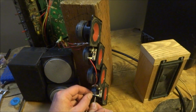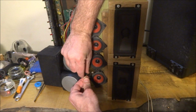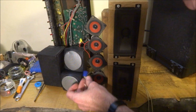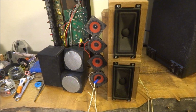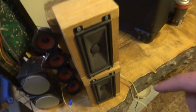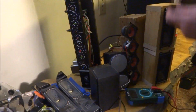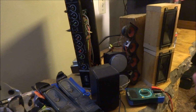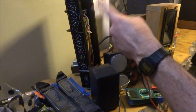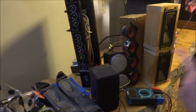So I'll alligator clip from the 7th to the 8th speaker, number 9, number 10, number 11. The negative from the 11th speaker to the negative return that goes back to the amp. Speakers number 8 and 9 and number 10 and 11 are more than 4 ohms each. So I think the total of the circuit with these 11 speakers, I'm gonna check it out with a multimeter. Get a reading of about 60 ohms of resistance. That might be enough to make this thing very, very quiet. Theoretically, this should not blow these speakers.